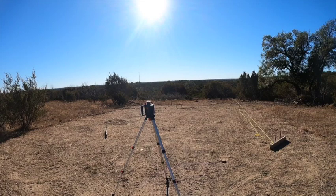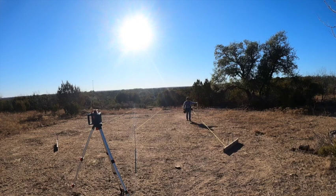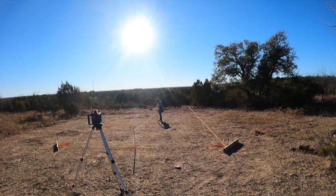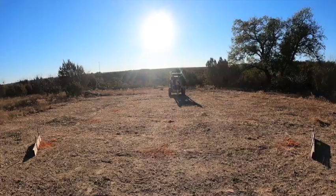These aren't going to be perfect — these are just rough so that I can get my pier holes dug. Once I get the pier holes dug, I'll pull these strings again, double check level, then set my sonotubes. When I set my sonotubes is when I'll go back with the sight level and really hone it in to being exactly precise, because that's going to be the level of the concrete that's poured inside of these sonotubes, which will be where my beams will sit — which will actually be the basis of my foundation.